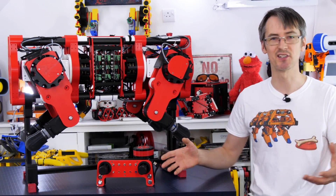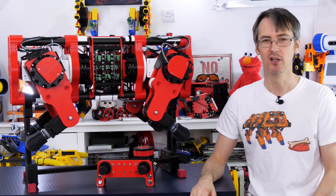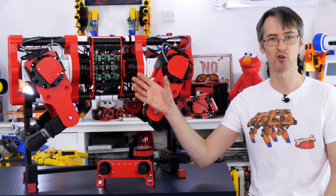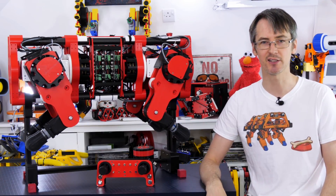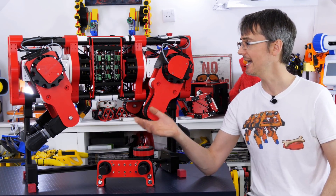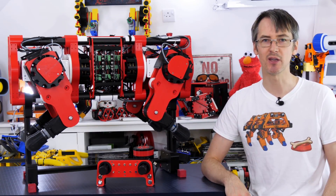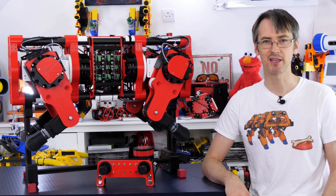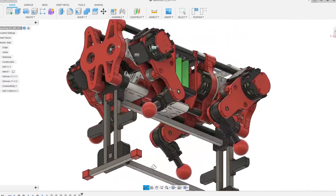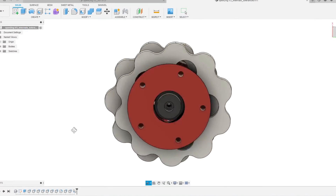I'm really happy with how this is working so far — we've got twice as much torque on each joint compared to Open Dog 2, so it feels much more solid and agile, and hopefully all those dynamics improvements can be done in the future. At the moment I'm not even reading the inertial measurement unit in the code although it's actually wired in, so that's data we can use in upcoming episodes. All of this is still PLA and it seems to be holding up okay — the cycloidal drives seem to be holding together and no parts have broken, so you can make it in PLA. I'm going to be publishing all the CAD on GitHub for the whole dog, the remote, the foot mould, and also a re-toleranced set of cycloidal drive internals because I had to make some adjustments for my 3D printer to get it to run smoothly.